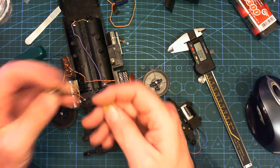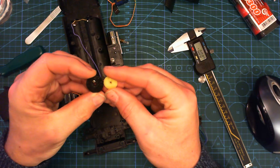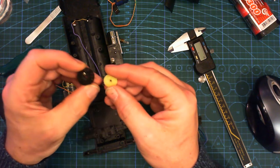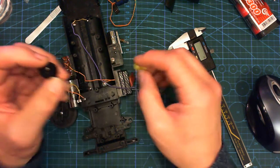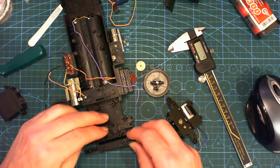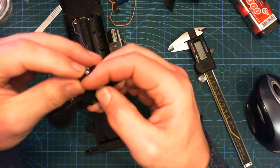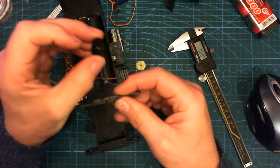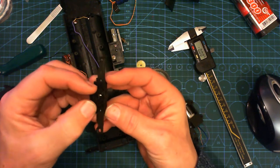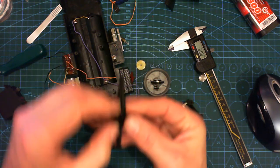So I've had to do a little bit of calculating, and I've banged a screw in there. It's just slightly closer in than that peg is on that, because this will travel slightly further than that did, to get the distance of movement. So the idea is that would drop in. It's a bit of a shame that everything's black on this. I might look for something a bit better than this screw. I do have a few of these little black bits. So that would drop into there, and then the servo, when it drives, will drive that each way.